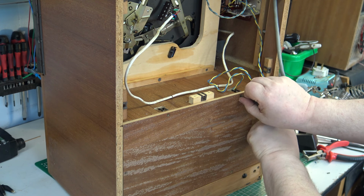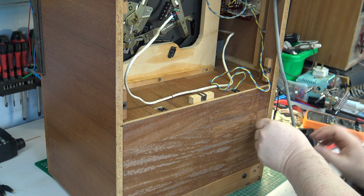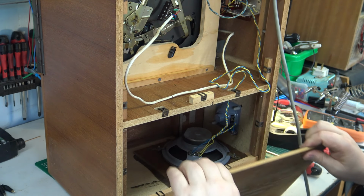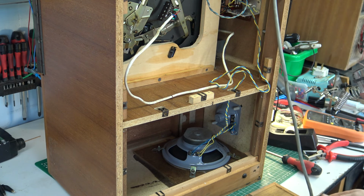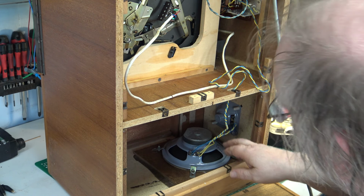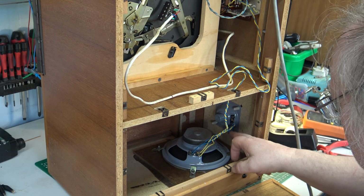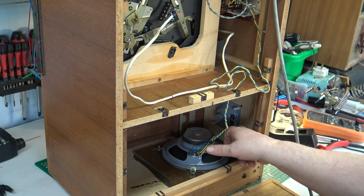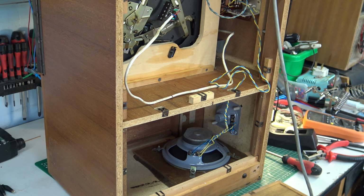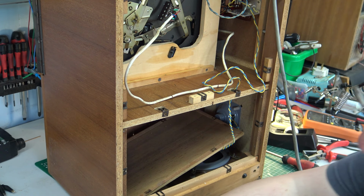These aren't like the 2419 where the speakers are always, the best word is knackered, with the foam surrounds gone. Now that one's fine. So I will just make sure the tweeters are working because of the capacitors there, which are non-polarised electrolytics, which can fail. I have had that happen before now. So I'll just put that in there for now. Put the screws to one side.